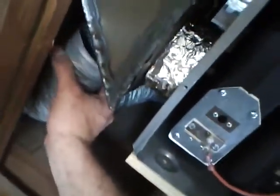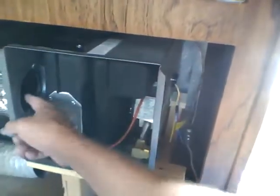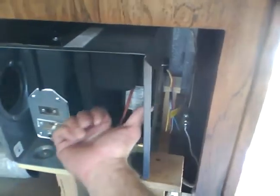And once I put this duct adapter back onto this duct and clamp it up there, this will slip right into place right here, hopefully. Right where that ductwork goes. Problem with this is, the specs say that this thing wants 25 square inches of outlet area to blow through. Now this one here, I don't have a matching hole over here.